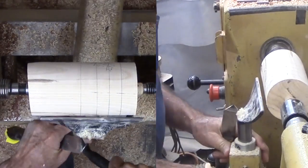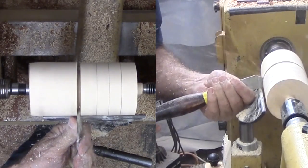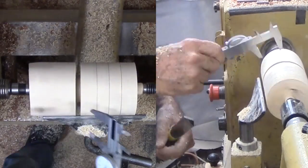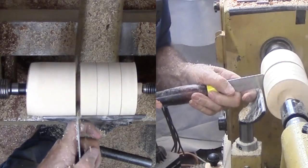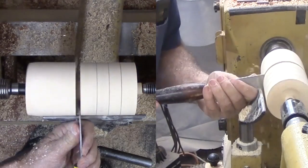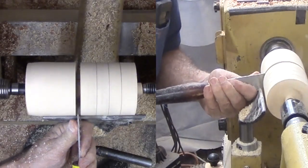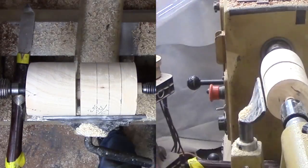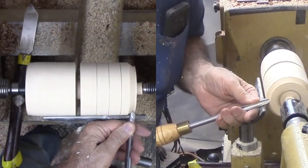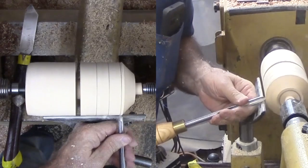This time I will start with the spindle end of the cylinder — there is too much wood to waste away. Instead, I'm using a parting tool to preserve some wood for a later project. Doing double duty, I'm parting down to a tenon whose diameter is also the length of the octagon's side. This will guide me later to cut a diagonal side. For the opposite end, I'm marking the side of the octagon as a diameter, then proceed to cut the diagonal side from the corresponding marks on the side to the tenon on the spindle side and the diameter mark on the live center side.